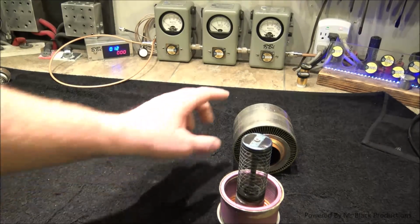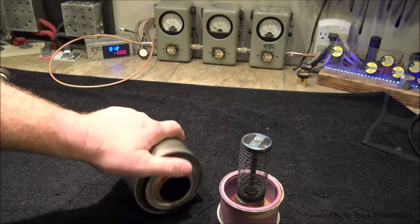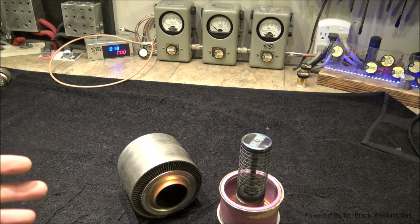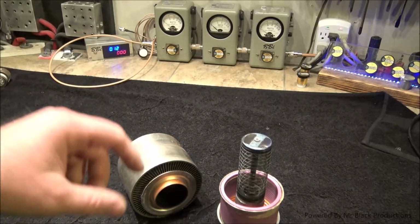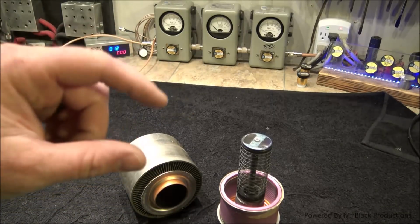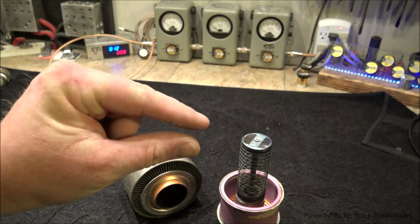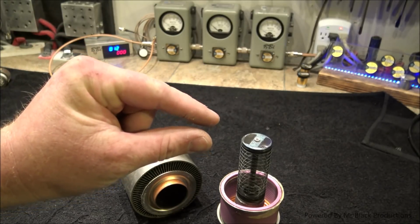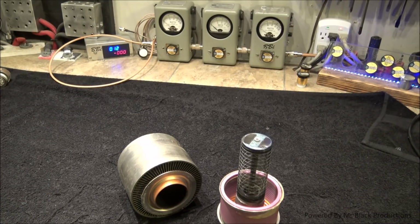Otherwise, where a portion of this screen is physically making contact with the anode in some way, shape, or form. So when you test with a multimeter and you don't get a beep, so there's no conductivity, we know that we don't have a hard short. But we have to test it underneath high voltage applications, because as we all know, as we increase voltage, our distance of insulation through space decreases. Okay, so all of a sudden, that amount of distance at 12 volts, which is an adequate amount of insulation, all of a sudden at 1,000 volts, you've got an arc taking place, an internal short. So that's what we're going to go hunt down tonight.